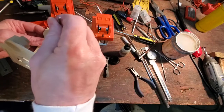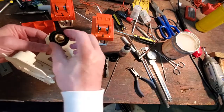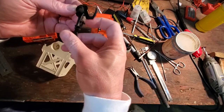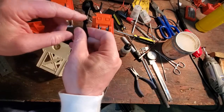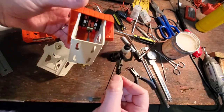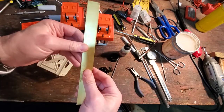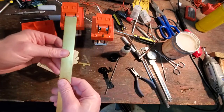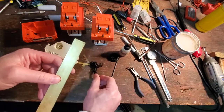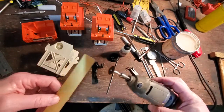The tab on that spring is important as far as the placement goes. This arm has a little springy piece that's supposed to hold this metal plate in position — it was missing on this one here. You can see that it's made of brass — in fact it's 20-thousandths brass that I had as extra stock. What I did was I used this as a template and then cut it to shape using tin snips, and then used a Dremel cutting wheel to cut it to shape.